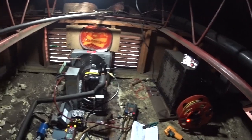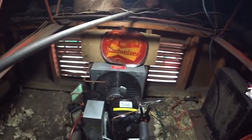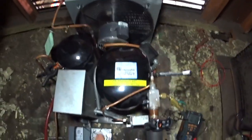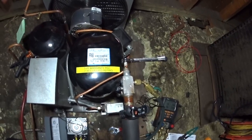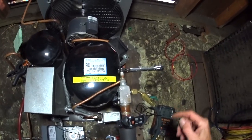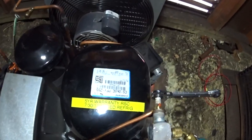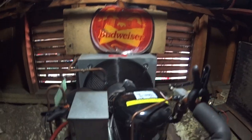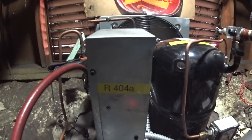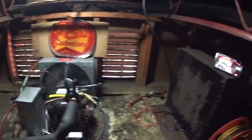This is the condensing unit — it's up on top of the walk-in cooler. I put it in last July. I like to use a P-Touch labeler and label everything. I usually put the refrigerant type on it — I should write 404A on it. Labeling is really important, especially for refrigerant, so when you go onto a system you don't make a mistake — or somebody else doesn't.